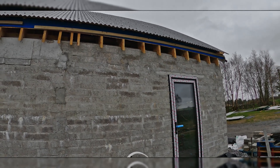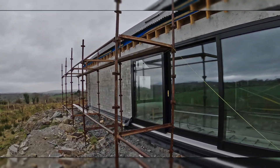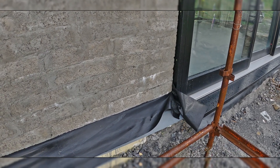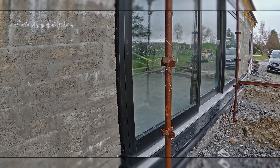Here there will be no overhang as well, so we do the taping around the windows and doors. As I said, this project is a little bit unusual — the windows they installed are aluminum, and we're going all the way to the footpath with the insulation, so there will be no plinth on this project.